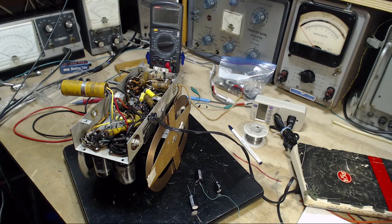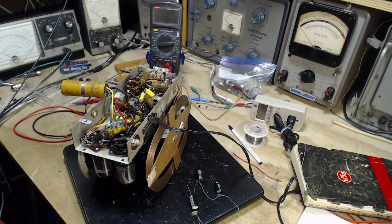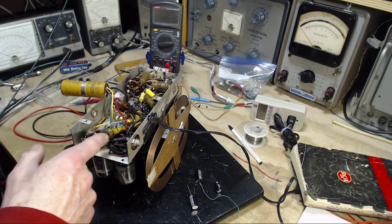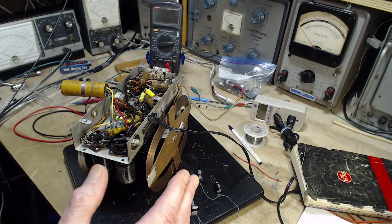The very last thing that happened at the very end of the last video was I snuffed out part of the hum, but not all of the hum that was in here. I snuffed out the part with harmonics in it, the sharper sounding part, and left behind a warmer hum. That, coupled with the fact that when I looked on the scope I could see a hum not only on the first filter capacitor lead, but the second filter capacitor lead showed a little bit of hum in it. So I think, you know what, it's time for this guy to go.